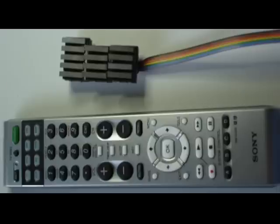And here's the finished product. I have 13 micro-switches — four of them are device-select buttons, and they change the function of the other nine buttons, so I could operate a total of 36 different functions using these micro-switches.